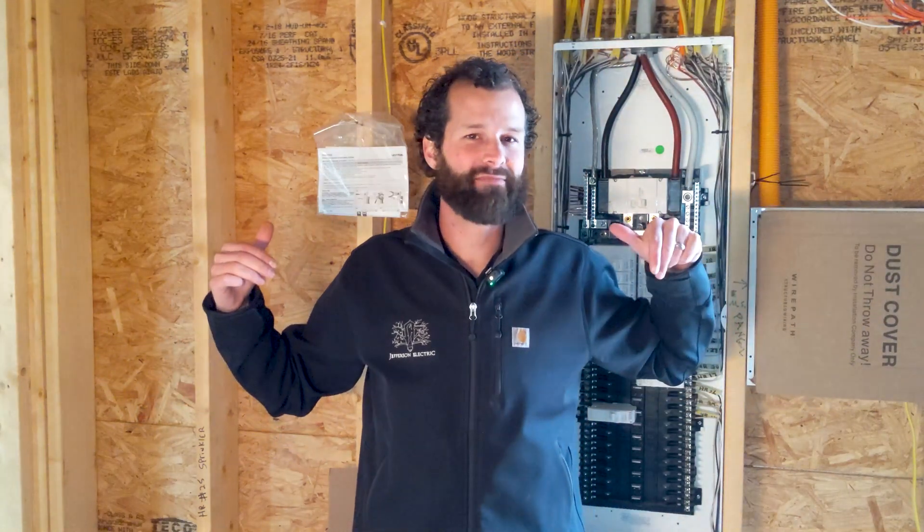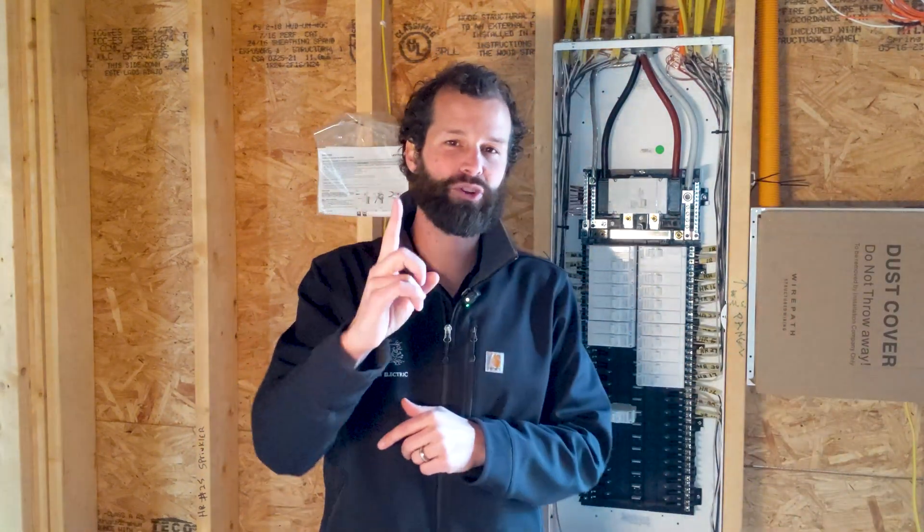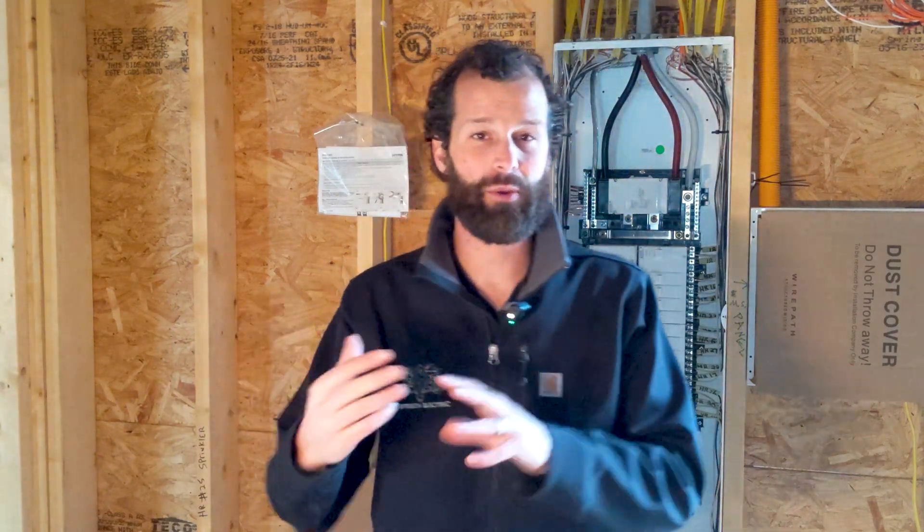In addition, the ability to be forward thinking. A home like this, built for $6, $7, $8 million — the last thing you want is to come to completion and realize you missed the boat. My advice from an electrician's perspective on a modern build: one, provisional conduits. Between the crawl space and the attic in the pool house, provide a 1-inch PVC provisional conduit. This home is so tech-loaded — even in the pool house there are camera, speaker, and smart lighting solutions. Provide a vehicle for easy adaptation to future requirements. Two, a provisional conduit between the pool house and the main house — we're actually going to have two: one for low voltage and one for power.